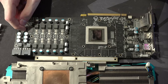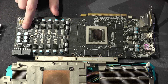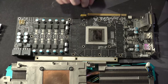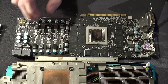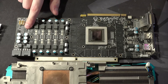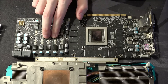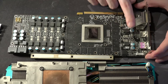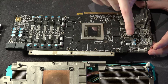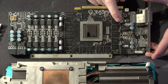In its maximum configuration it's a 6+2 phase. So here it's running as a 5+1 — the plus-1 has to be used for your VDDCI. So here it's running 5-phase Vcore with the doublers to get 10 phases, and then plus-1 for your VDDCI all the way over here. This chip offers temperature monitoring for all of the phases hooked up to it. The VDDCI sits right next to V-MEM so you actually indirectly get temperature monitoring for both, because if VDDCI is cold, V-MEM can't be hot — they're literally right next to each other.